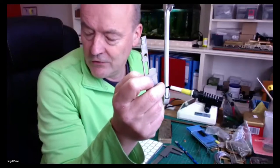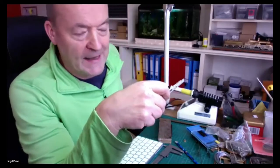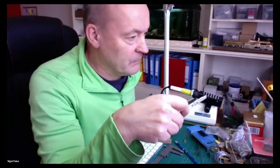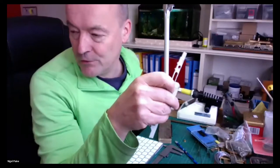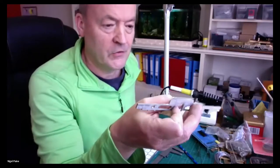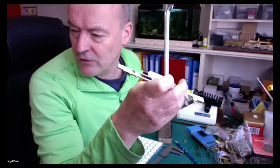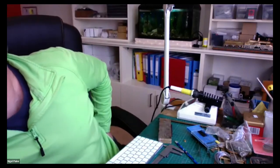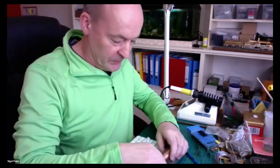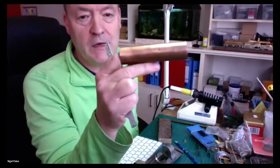There's no space. There's modeler's compromise, of course, because in 7 millimeter scale, the back-to-backs are not as per the prototype. I'm not doing this in scale 7, so I've had to make a compromise. The boiler is about a scale 3 inches narrower in diameter. It's 4 foot diameter unlagged. So it should be 4'3".